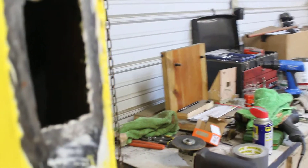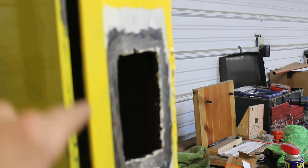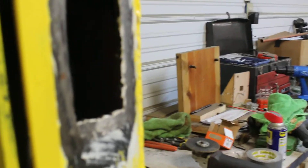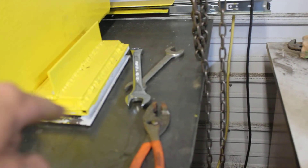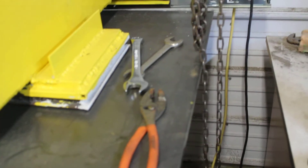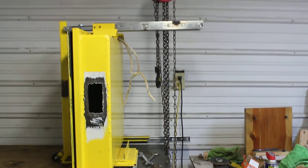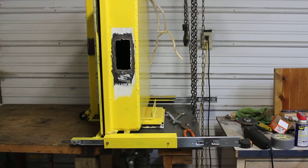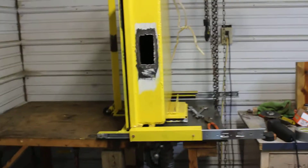Around the door — the door just pivots back over like that, we slide the door shut — around the inside there's a big heavy-duty vacuum-rated seal that's going to go around that so the door gets sealed, and once the vacuum is initiated we won't have to worry about that. It fits perfectly, so it'll seal up very nicely. The same type of seal is going to be put under this part that seals it down to the base plate. Like I said, I've got a lot of work to do — I still have to put in all the ionization gauges and thermocouple gauges and all that. But I wanted to give a quick update, so thanks for watching.